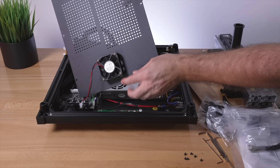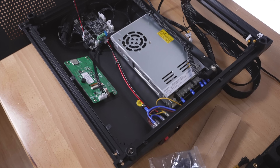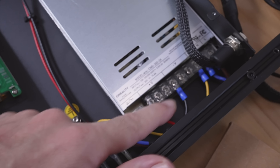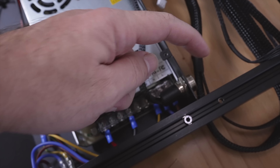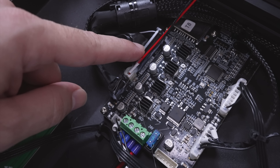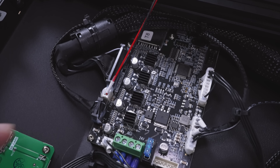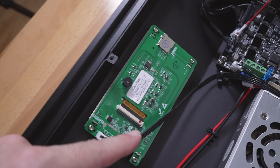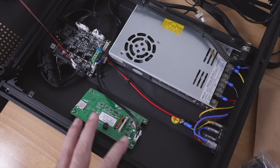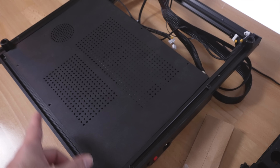We do have a large fan connected to the backside with the connector hot glued. Here we have the power coming in going into a Creality-branded 350-watt 24-volt power supply — all connections look nicely organized and crimped. There's a port from the bed running to the main board, which is Creality's latest board with integrated stepper drivers with heatsinks, an ARM processor, and a full-size SD card slot. Everything is hot glued, routed, and organized. There's also a touchscreen board and a little beeper. Very well put together and simplistic — I like that about Creality.